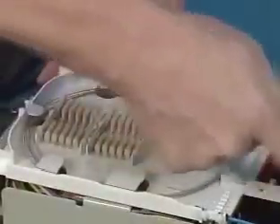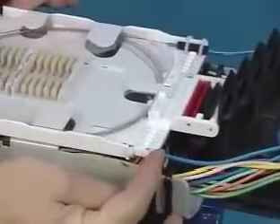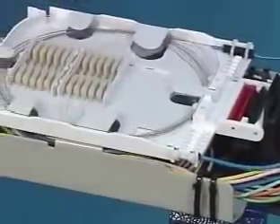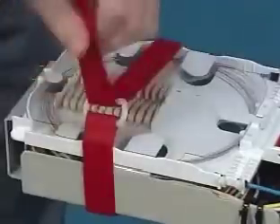The tray can be locked in the up position by using the red kickstand feature. Similarly, for A and B closures, a tray prop is provided. Note one of the benefits of hinging trays is the ability to route buffer tubes directly to the tray in the event of fiber breakage or if insufficient slack is available. Secure tray to basket using Velcro strap.